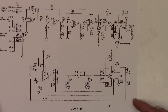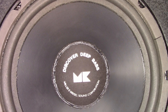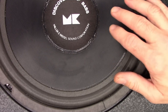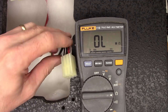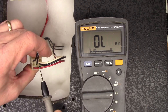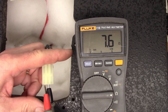I'll contact my customer to approve this repair. My customer indicated he just recently had the woofer re-coned or re-surrounded with new edge surround. It does look like it's been redone and the surround is in excellent shape. I don't hear the voice coil scraping on the magnet whatsoever, so they seem to have done an adequate job. Let's check the resistance of the speaker to make sure we're not in the 0-to-5-ohm range that could damage the amplifier. Probing the two speaker leads, we see 7.6 ohms - perfectly fine DC resistance for an 8-ohm speaker. The speaker is in fine shape.